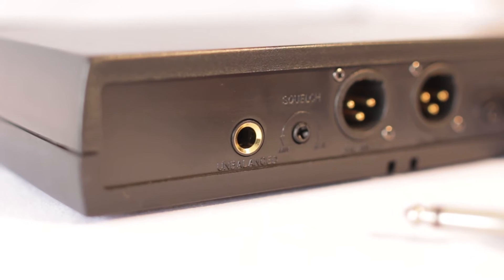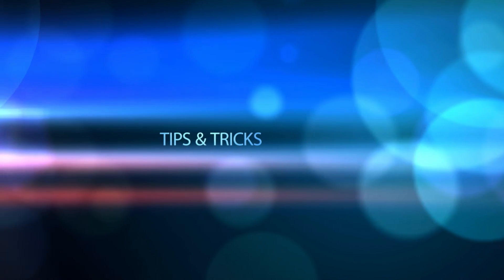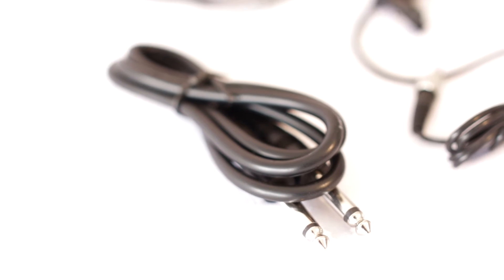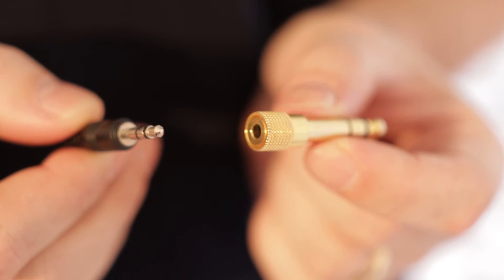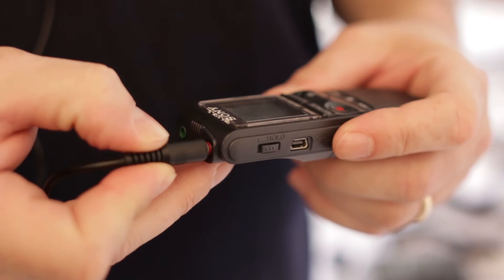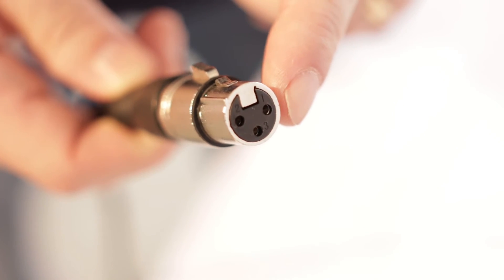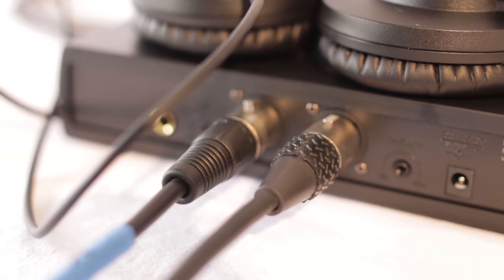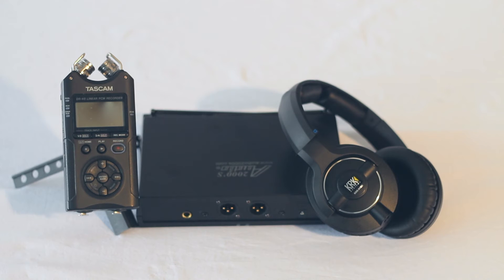Now test the next unit. Plug the jack plug in and start to record. If you use the jack cable, you'll be carrying two channels of unbalanced audio — left and right. This is perfect when using adapters for compact, simple recording devices like this Sony MP3 voice recorder, or converting to a DSLR. For higher quality recording, you should use two balanced XLR cables and connect to the XLR ports provided. Connect the main unit with each balanced cable directly to your mixing console or field recorder, such as this Tascam DR40 or a Zoom H series.